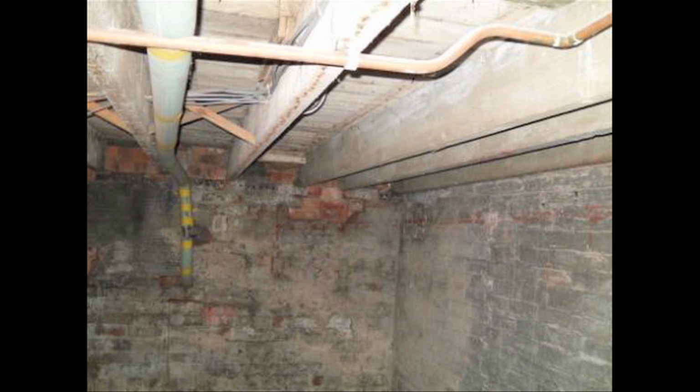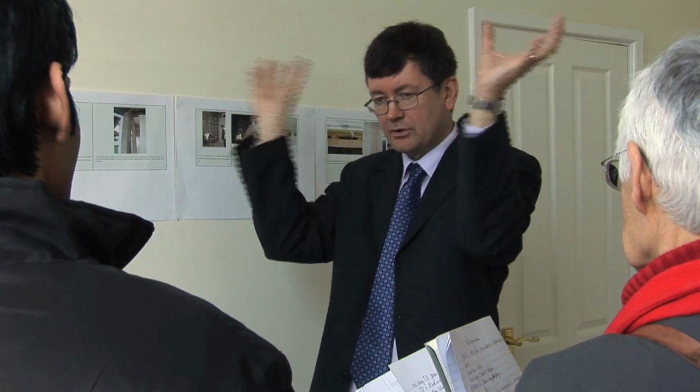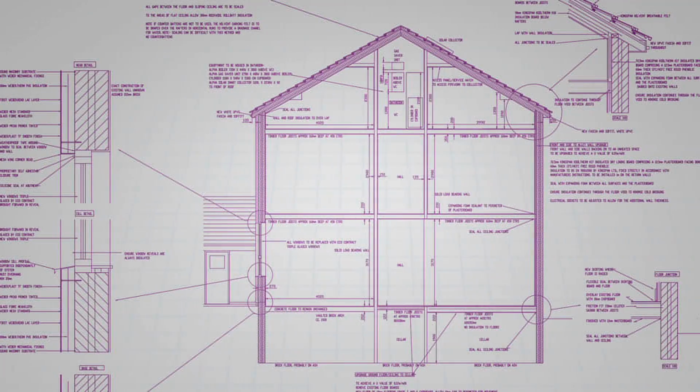This room sits over the cellar. We've insulated between floor joists. We've just pushed board up into kind of push fit there, and then we've covered that up with a layer of plasterboard. So we added another couple of 100mm of insulation under the floor to try to reduce the air changes in the property, the ventilation heat losses. We've put a piece of chipboard on the floor, very cheap, very easy, just to seal, make the floor airtight, and then we've put polyurethane foam all around the edges of the floor as well to really work hard to reduce the ventilation heat losses in the property.